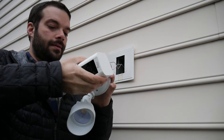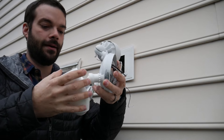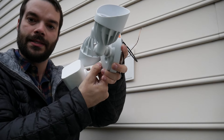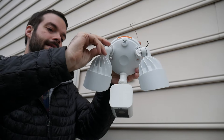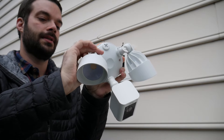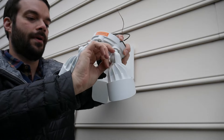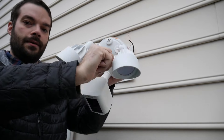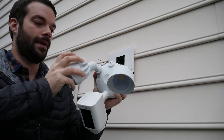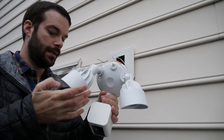The Ring floodlight ships with the lights loose and the camera itself upside down. Grab the camera, spin it around — there's a little locking lug — so the lights are on top and the camera is on the bottom. You can spin the little knob and set the lights wherever you want for now. Once installed you can choose final positions, but tighten these knobs so things aren't flopping around. It's fully adjustable: up, down, left, right.